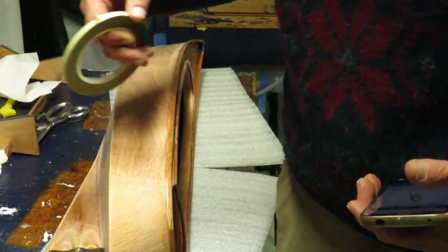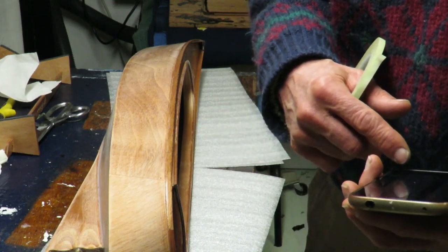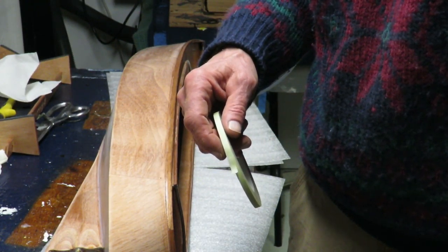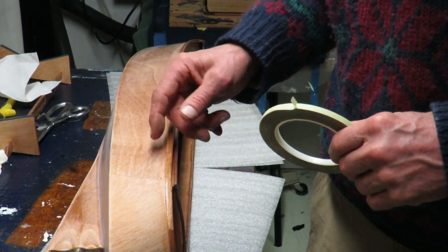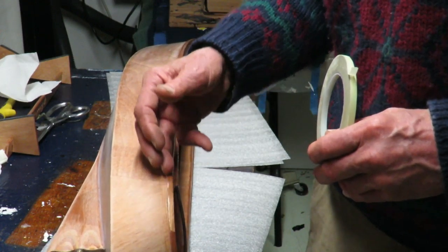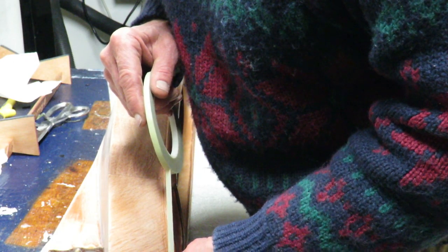That's what we'll be taping off the rub rail with. Since the rub rail does have varnish on it, you could use a regular masking tape, although the quarter inch width is going to be more convenient for this job. With regular masking tape, there's more chance of getting some paint bleeding underneath. However, the paint that gets underneath isn't going to soak significantly into the wood grain, since we have it protected with varnish. So you would be able to sand that off later, but that's extra work. So let's just use this fine line tape and tape it really precisely.